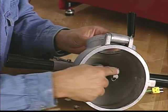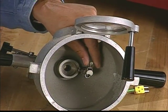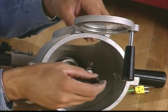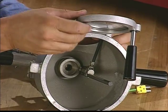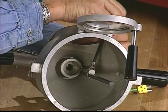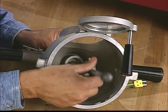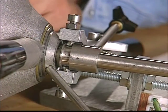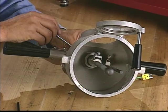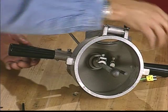Adjacent and parallel to the sealing rod assembly inside the hood is the carbon stirring rod used to stir the hot metal. If it is not installed or needs replacement, you would do this now. The stirring rod is held in place with a clamp also requiring a five millimeter allen wrench. This clamp assembly does not come out of the hood. Open the glass access door, loosen the clamp, insert the new stirring rod, and tighten the clamp. To install the sealing rod assembly, insert the metal tube end up through the top of the hood. The tube must go through the adjusting knob collar which is normally aligned in the u-bracket at the end of the release lever. Push it up as far as it will go and then turn it so the allen head clamp screw faces the window. Tighten the adjusting knob to hold it in place while you put the hood back on.